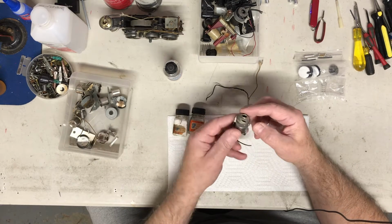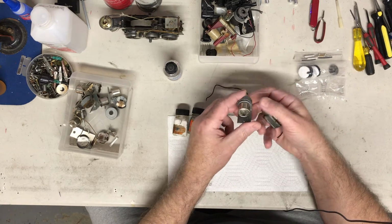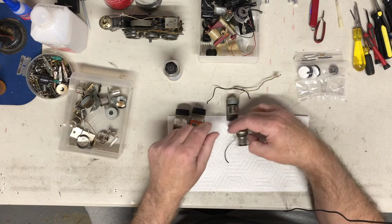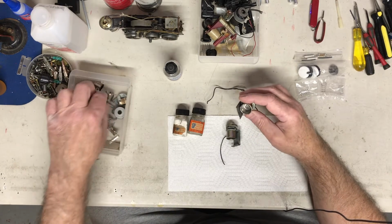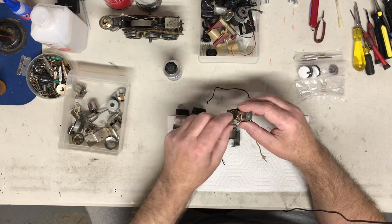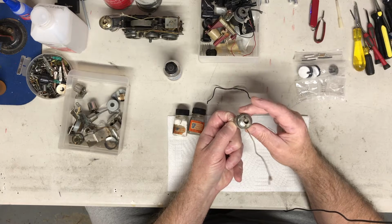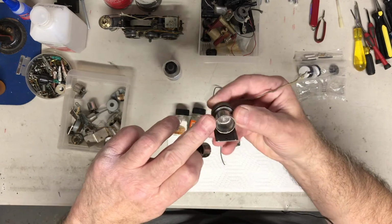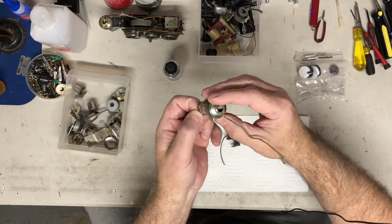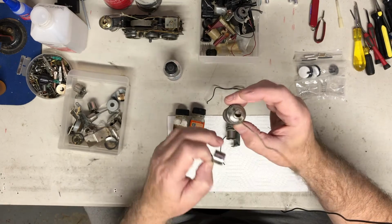Here's another one. It's in bad shape, and it's pretty nasty inside here. But you can see these both have the hole inside here, which is set up for a piston, a little metal piston that drives that. Let me get one here. That goes inside, and it goes up and down. And it puffs smoke, it pushes air. There's a little hole in here. I don't know if you can see that. There's a little hole inside here which comes up through, and every time this pushes air up, it pushes air into this chamber, and it pushes the smoke out through the top of the engine.